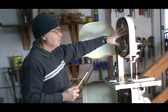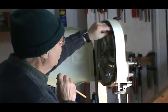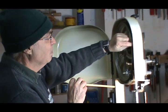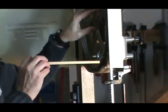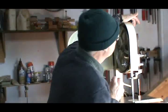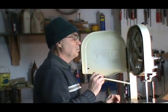Another thing you've got to be aware of on a consumer grade bandsaw like this: your blade, which has a crown in the middle, is always riding in the middle. There's a slight crown on the bandsaw wheel on these consumer grade bandsaws, and the blade runs in the middle. I don't really recommend anything over half an inch on a 12 or 14-inch bandsaw, because frankly they can't be tensioned up that well. Some people have replaced the tension guide, but if you're going to go to a lot of trouble and spend a lot of money, you might as well get a much better bandsaw.